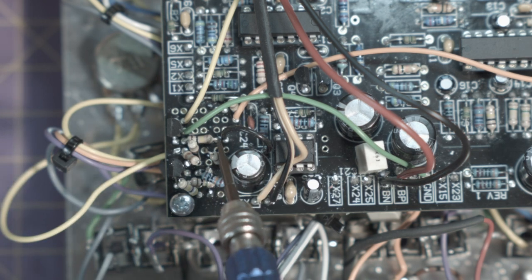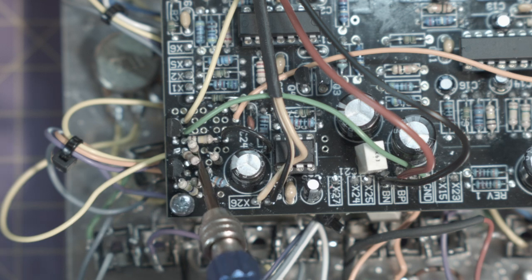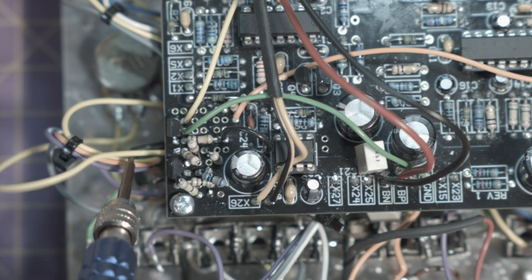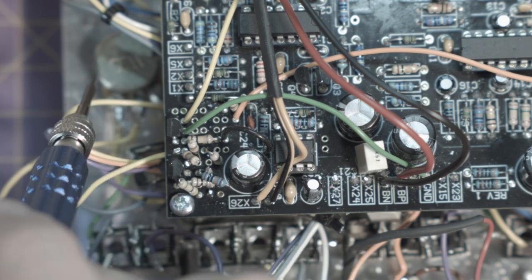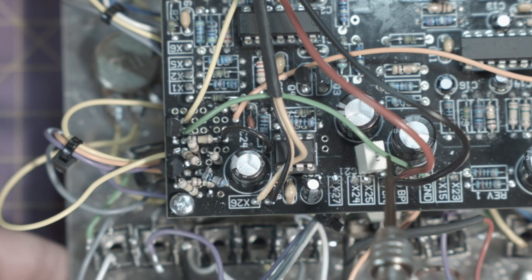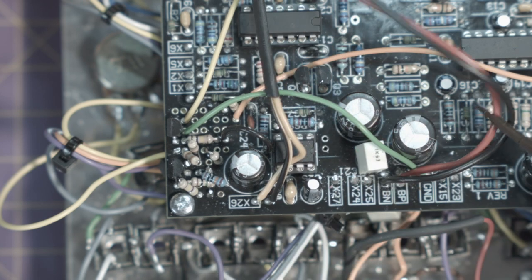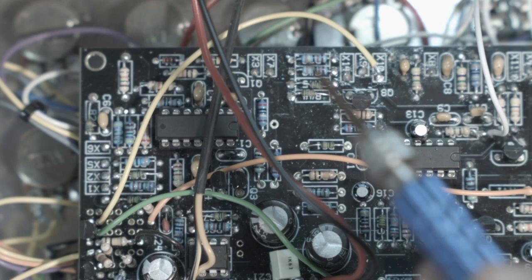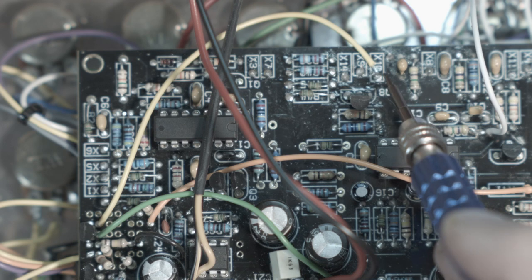So, 100K above battery negative, 39K to the junction, then 100K to the battery positive, 39K, and then this is our signal input there, coming from our modulation source that is coming from the faceplate, from this potentiometer that we had done in the previous video. That is our extra modulation. Then the source middle pin is connected over to this green wire to the extra ground point. And the drain is simply connected over here. I laid it flat and connected to X10.